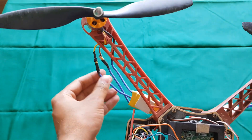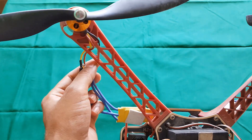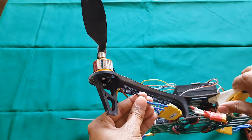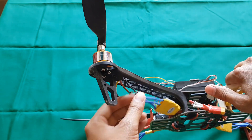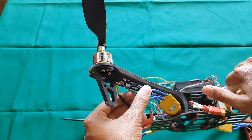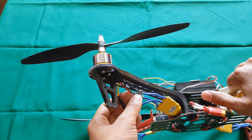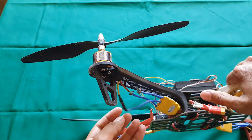Here comes the third thing which will complete around 50% of your work: how to connect your motors to your ESC in the right manner. For connecting motors with the ESC, I recommend using bullet connectors. These connectors are very useful. I would not recommend doing the connection without them because it drains energy, and bare wires can touch during flight, causing a motor to stop and your quad to fall down. Bullet connectors are safer and very convenient.